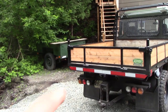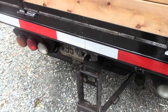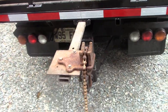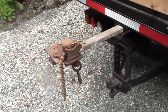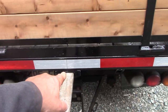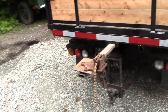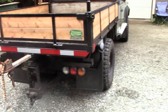This extension piece is where you could put a vice on - there's a bolt that clamps it into the side. In this instance we've got a pipe hold-down clamp. When we were doing plumbing and cutting threads onto some strange-shaped pipes this was excellent. The piece goes all the way through the truck so it's quite stable and strong. I copied the idea from one of the electric board trucks.